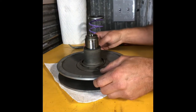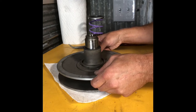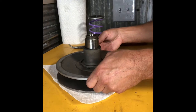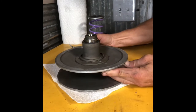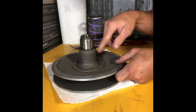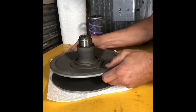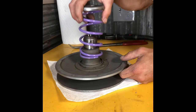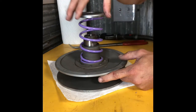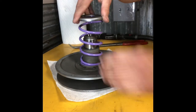You can see the spring is off of the secondary. I've done that to speed up the video, but I will show you the reinstall procedure without the spring compressor. As the belt shifts up and down in the sheave, as the secondary cycles it doesn't just move straight apart — it actually rotates. So inside this collar you will have some pins and some curved grooves that everything rotates in, and your secondary spring sits here.